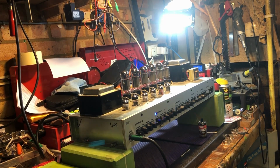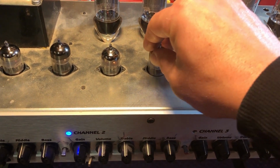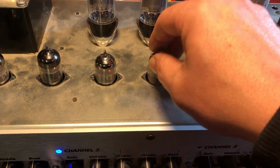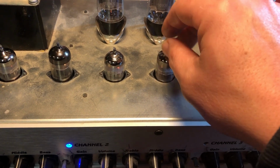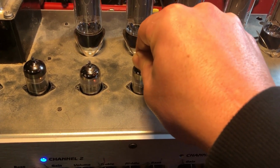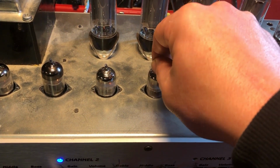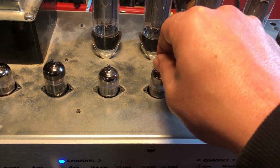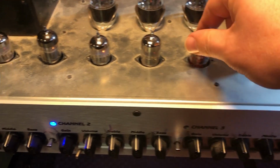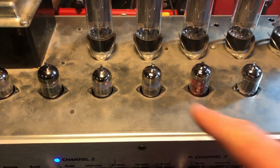Oh, excited. So here we are back again. So it was the phase inverter and this one that was still noisy. Oh, you're still doing it. Phase inverter fixed. Right, I've retensioned that all I can. So what I'm gonna do next, I will probably just reflow a little bit on that. Sometimes just a wiggle will be enough, but that obviously needs a bit more cleaning. It's all good. Just that sod again.